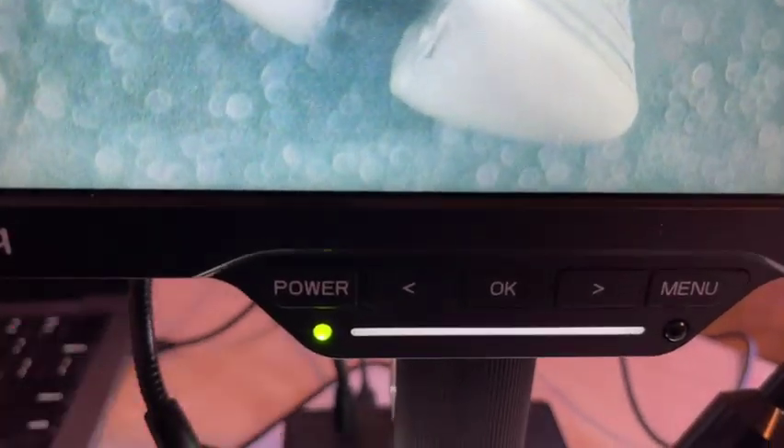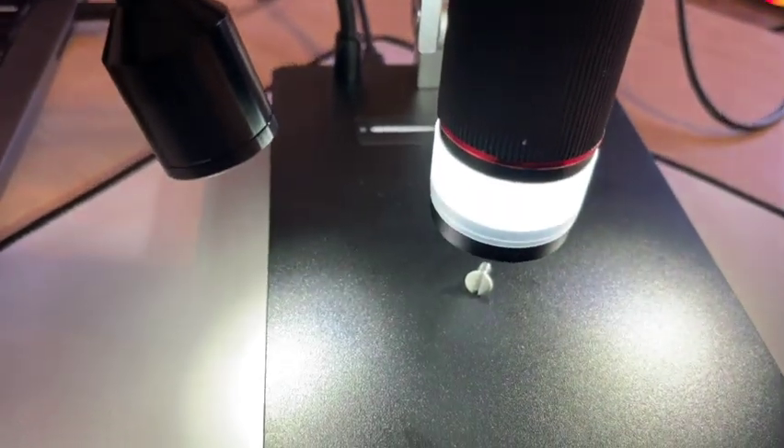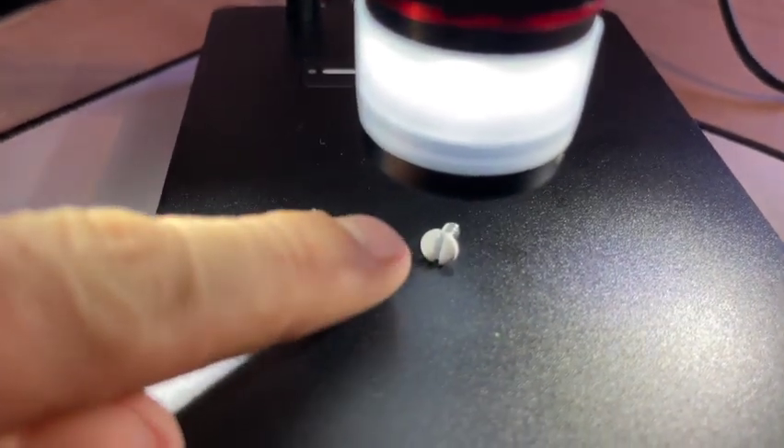You can change the brightness of the LEDs inside the microscope with the slider — it dims and gets brighter as you make that adjustment. Fine-tuning everything is important depending on what you're magnifying. We also have the height knobs — as we turn them, we move the camera closer to the screw. When you get too close, the screen loses focus, so you just turn the focus knob to get back into focus. You can get really close and see the threads and the head of the screw in great detail.